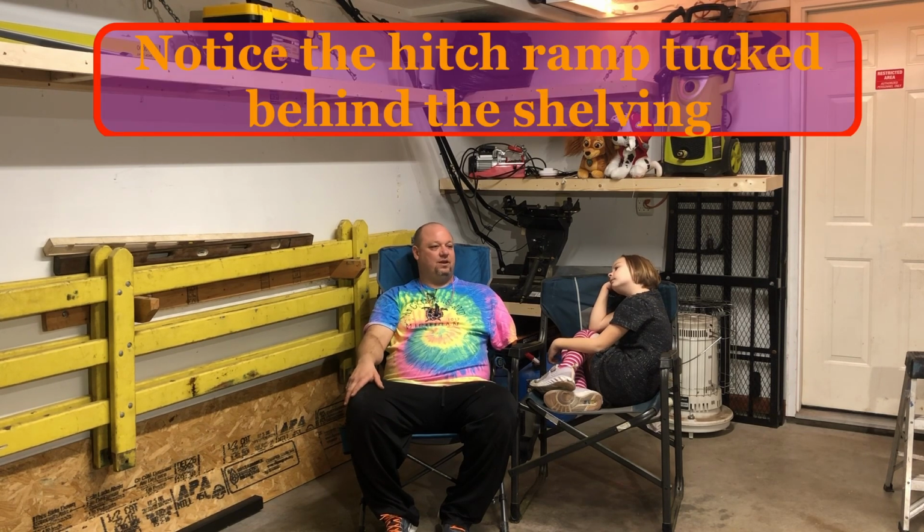So when I started doing projects, I started thinking about how do I keep the scrap pile small? Because lots of scrap is money out the window, right? Because I paid for it, but I'm not using it, right? So I figured out after 20 years of building stuff that if you take a piece of wood and make the longest cuts first and then make the next longest cuts, you end up with a bunch of little teeny pieces. And in general, pieces 12 inches and under I consider garbage because they're too short to do anything with.